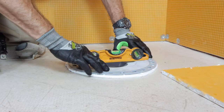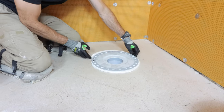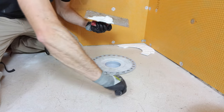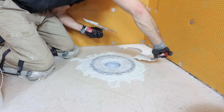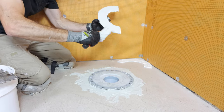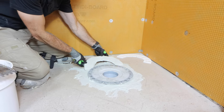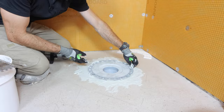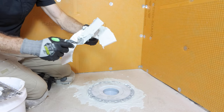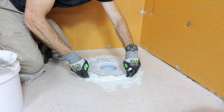Make sure that it's level — this is a critical step. You need the drain to be absolutely level so that it will drain properly when your finished shower is installed. Then you can pull the foam inserts and put those aside, and apply some thinset underneath the bonding flange and between the floor. You want a copious amount of thinset between the flange and the floor, and also put a lot of thinset on this foam insert — both on the bottom and on the top. The reason why I split it in half is because I need to put it in between the floor and the drain. This is going to be supporting the drain because there's a little gap underneath there, and this is per the Schluter instructions. You definitely want to use this foam insert or foam spacer underneath the drain. Don't skip this step because if you step on the drain, it could possibly crack or damage the pipe — there needs to be support underneath that. And there needs to be a lot of thinset between the drain and the foam insert as well.